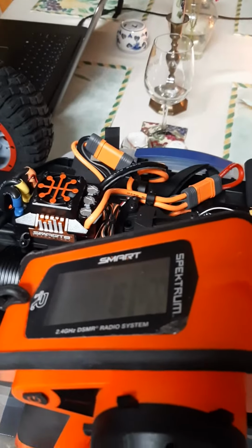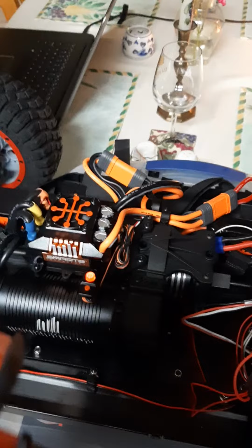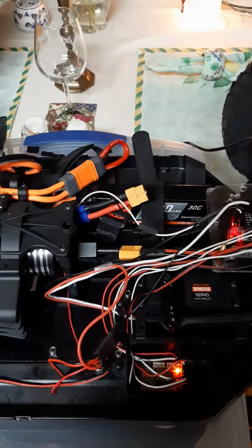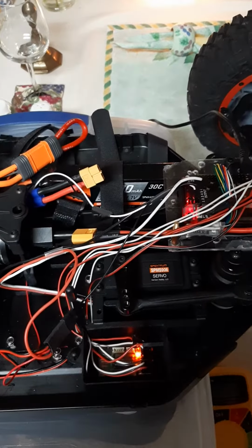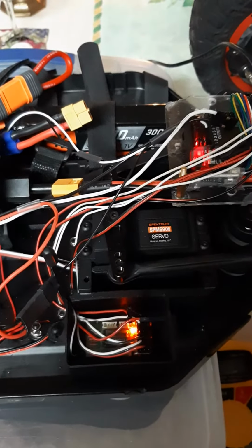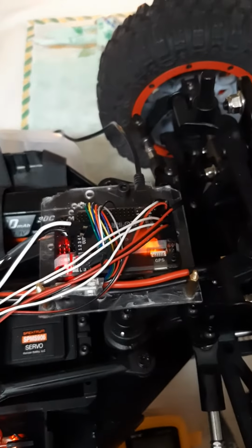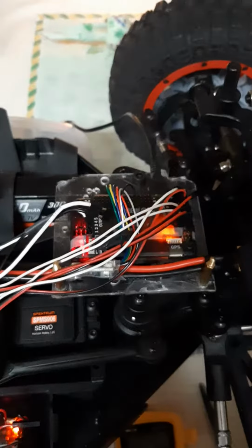All right, we just finished calibrating the ESC and solved our pulse width modulation signal instability. Basically, we had a problem with the signal being unstable coming from the receiver because it was being powered from an 8.4 volt BEC, and I'm using a 5 volt power supply on the computer. Of course, those two aren't compatible.